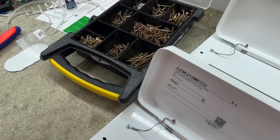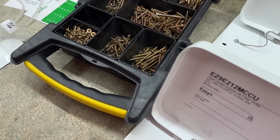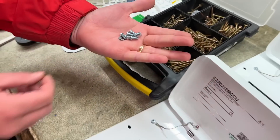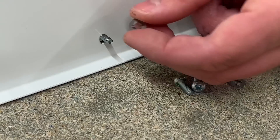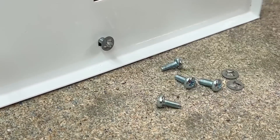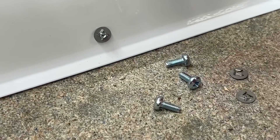Hold on, Rick — you've got the old inch and a half eights out in order to hold the consumer unit cover and I've seen it many times before on domestic consumer units. Well, I think I'm going to opt for the metric captive screw. So let's pop those on then. I do love a captive screw, especially on a consumer unit cover. There's nothing worse — whenever you take it off, it drops and goes left, you look right, you can never find it.